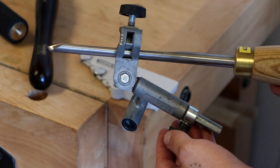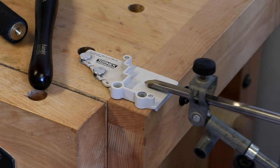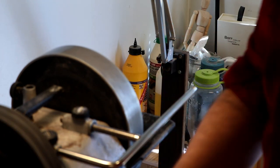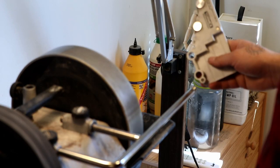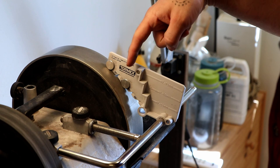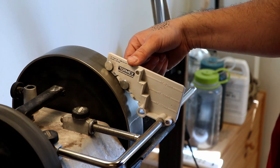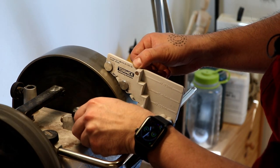I put this SVD-186 jig and set it on the middle protrusion here. Then I use this tool — the same tool actually. When you've set the protrusion as before, you put this in the first hole — A or B, this is A — and now it's already set. But you have to adjust it so these two wheels will roll. It's actually a bit uneven — there you go.